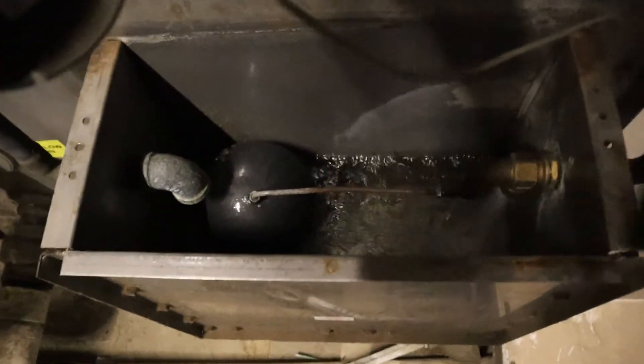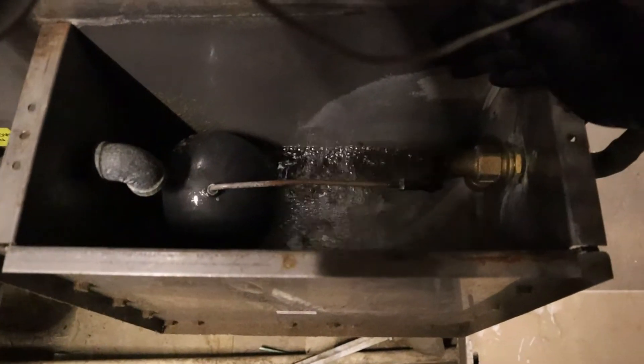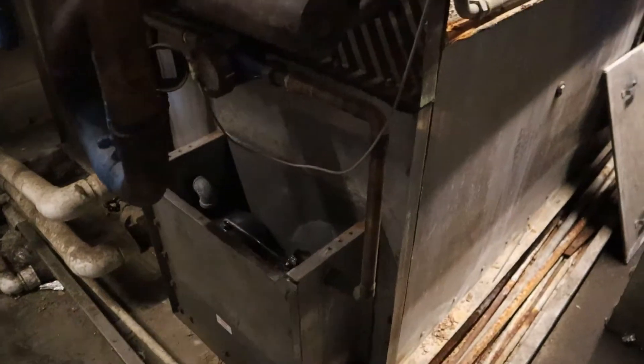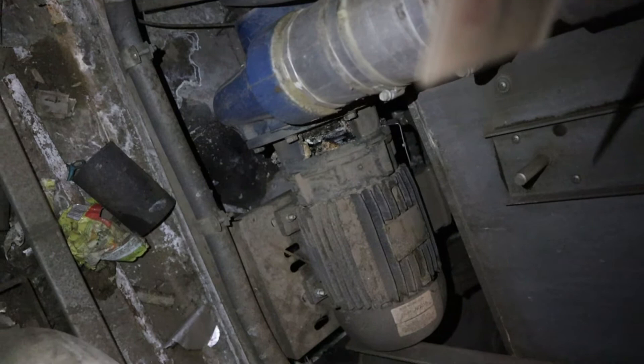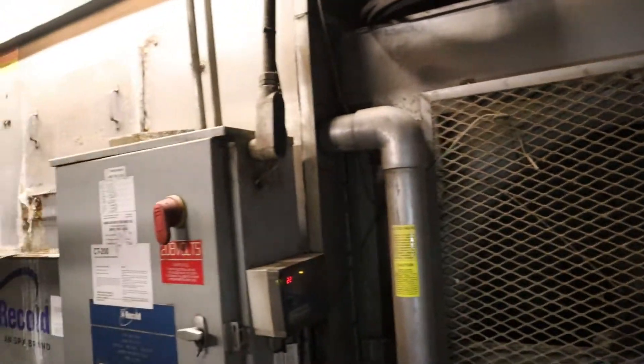A little float — not satisfied, satisfied, not satisfied, satisfied. And then the pump right here. Give it a little spin — it's running backwards. That's just great; gonna have to reverse that rotation. Rotation reversed. So you can see how the water shoots up into the condenser on top of the bundle.